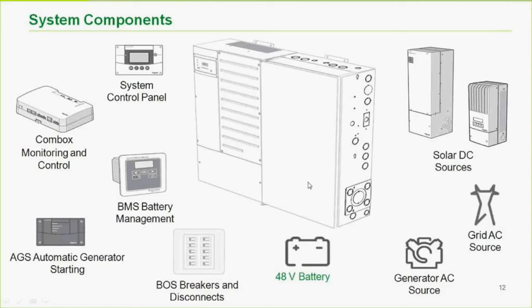And when it goes through an AC coupling routine, we get the losses of the grid tie inverter, we get the losses of the inverter charger, and then into the batteries, where on DC coupling, we're going straight into the batteries via a very high efficiency charge controller. So there's my 2 cents. I prefer DC coupling.